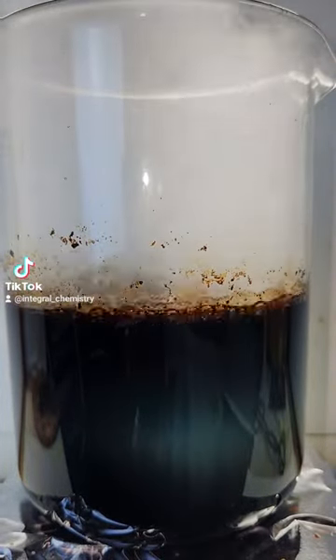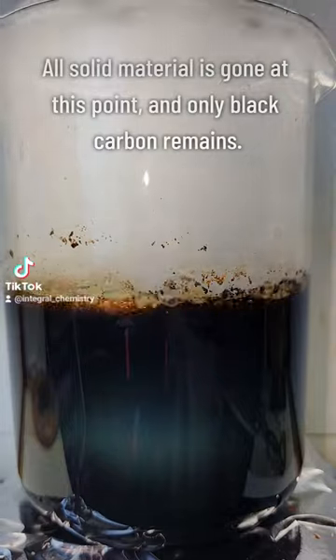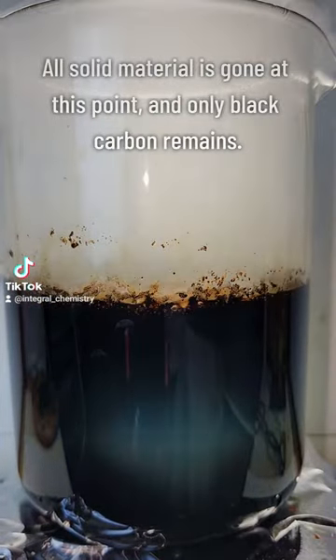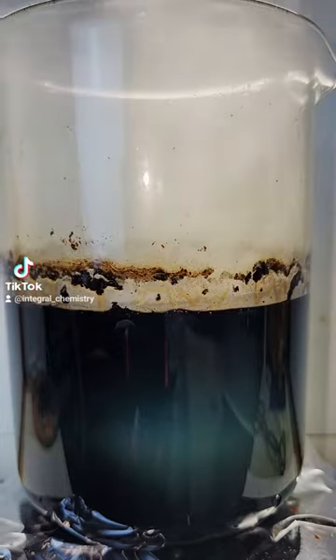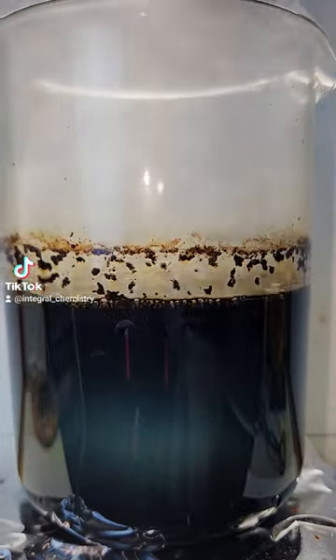This residue is formed because when you dissolve calcium in sulfuric acid, you get a salt called calcium sulfate, which is completely insoluble and more commonly known as gypsum. The gypsum forms a gooey layer on the bottom when this is allowed to settle.